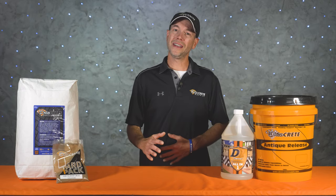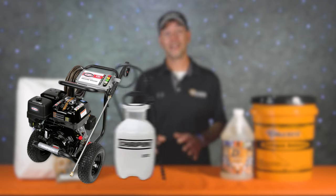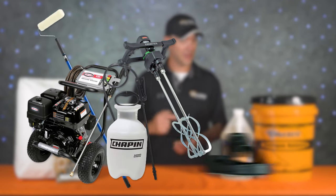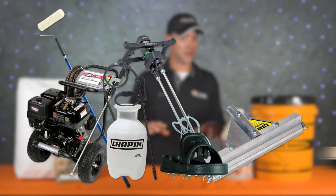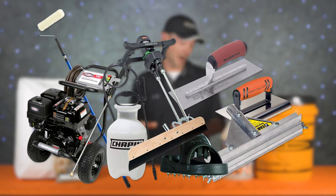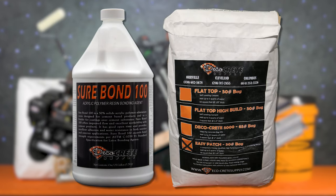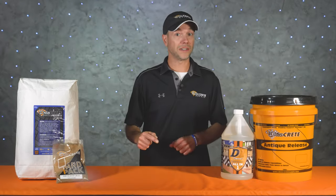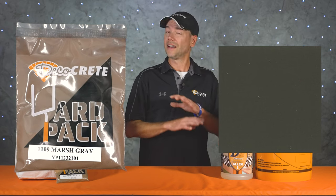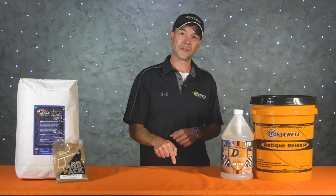The tools and equipment we're going to need on this job are a pressure washer, pump-up sprayer, a roller frame and a few covers, a heavy-duty mixer, pair of spiked shoes, a gauge rake and a topping smoother, as well as a few steel trowels and an edger. We're also going to need some Sure-Bond 100 to prime the surface and a bag of Easy Patch just in case we need to do any repairs. For today's project we're going to be using marsh gray color and soapstone powder release. These tools and products are all linked down in the description below.